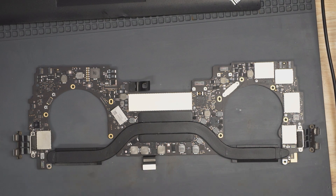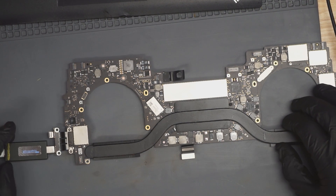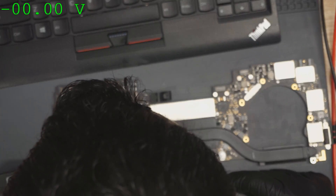Let's see if after unplugging everything from this MacBook it's able to turn on. We've plugged the MacBook charger in and it's still stuck at 5 volts, meaning the USB-C chip is not negotiating with the USB-C charger. Let's take a look and see if PP3V3_G3Hot is present. Oh look — a solder blob. Let's take a look at this PP3V3_G3Hot circuit and see what they did to it.